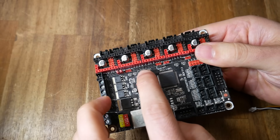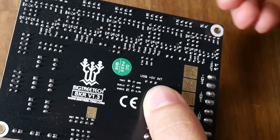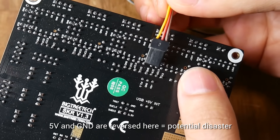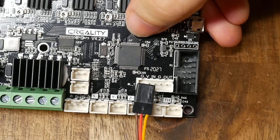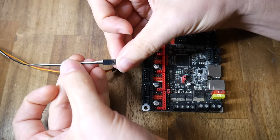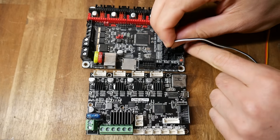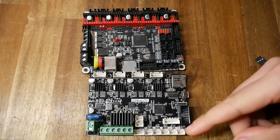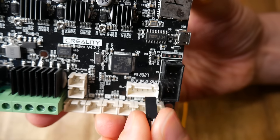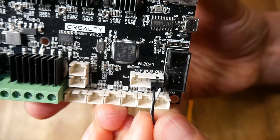Most modern mainboards have a dedicated port for these three pins. Here on an SKR version 1.3 we can see the 5V, ground, and signal, however when we line up the extension plug we can see the order is different. On this Creality board however everything matches and the plug could go straight in. Never assume the order of the pins is correct — always double check before you plug it in to avoid letting out the magic smoke. The black and white wires are for the BLtouch to communicate when it's triggered back to the mainboard, just like the Z axis endstop we're replacing would when homing the printer. Because of this we can plug in the black and white wires into your existing Z endstop port, pairing black with whatever is labeled ground. Some boards have a dedicated BLtouch input for these, which will work just the same but requires a bit more firmware alteration.